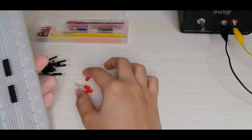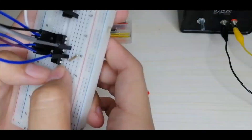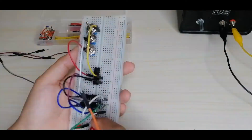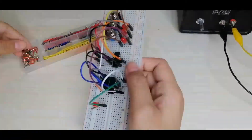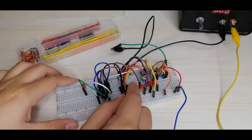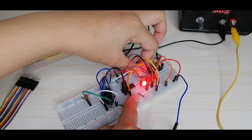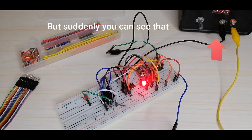I tried to build circuit B on the breadboard, and when I turned on D4, the output IN6 turned on and the LED became logic one. However, the voltage on the power supply then dropped, so I immediately turned off the power supply and found that the IC had become hot. Based on the simulation, when D4 is turned on, IN6 is at logic one, consistent with the JK flip-flop behavior. That's all for today — I hope you learned something new about D flip-flop and JK flip-flop. Don't forget to subscribe and like this video. Thank you!